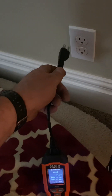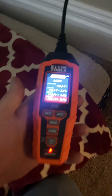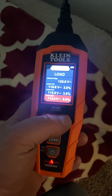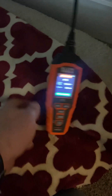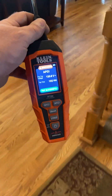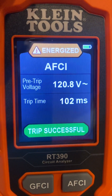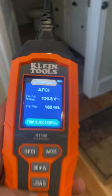My whole house is GFCI and arc fault protected, so let's see how it does on that — we'll test off my arc fault breaker. The circuit's off because I just heard the battery backup on the computer kick in. It tripped, and it tells me how long it took to trip: 102 milliseconds.